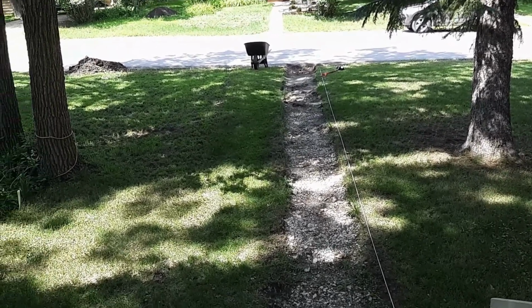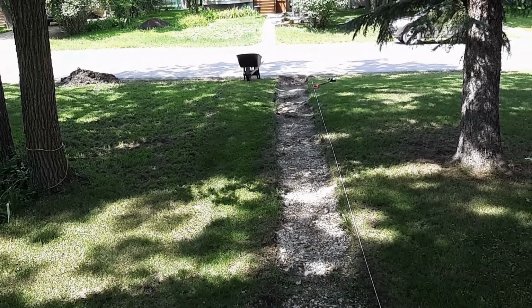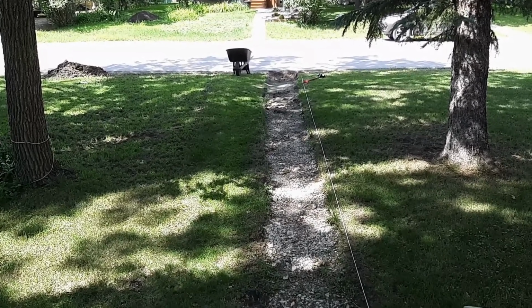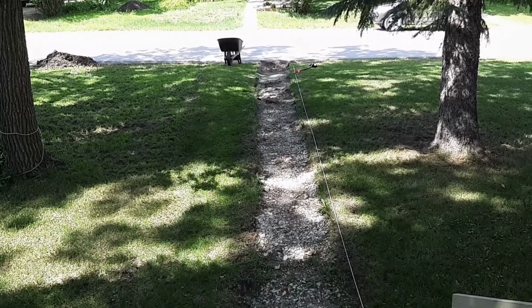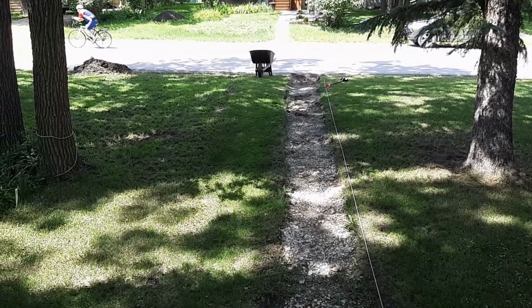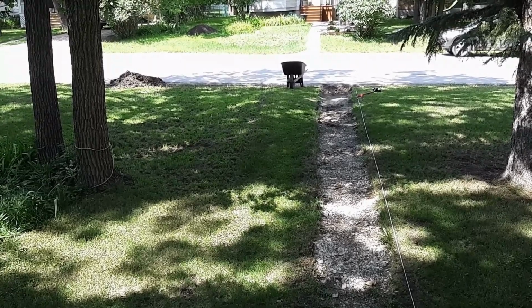Minimum 8 inches. But because it's cold and there's a lot of snow and I don't want my bricks to buckle, I might go down 10 inches. But I've got to go down 8 inches, then lay gravel, then compact, then cement sand, then compact again, then my bricks. So that's what I'm doing. So far I've dug out 5 wheelbarrows full. I'm putting it over there, and then a friend's going to come and help me haul it away in their truck.